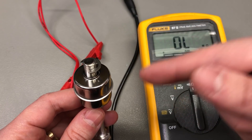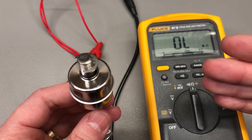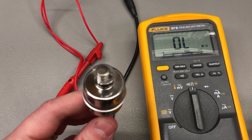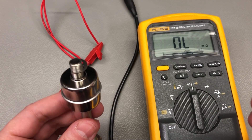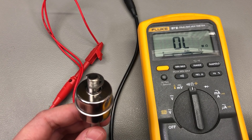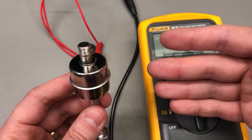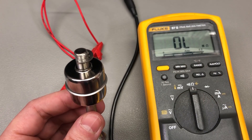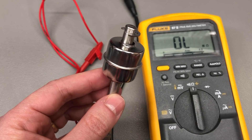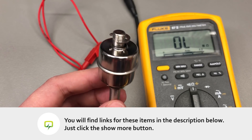Using this sensor, you can't sense the actual level of liquid inside the tank, but you can determine that the level has reached a certain top point. There's some degree of error since I'm not sure about the repeatability, but for an industrial application sensing when a big storage tank is full, a couple of percentage points off is unlikely to be critical. The good thing is it can operate up to 125 degrees Celsius and can even switch mains voltage — I wonder if it uses a reed magnetic switch inside.